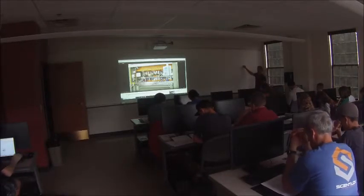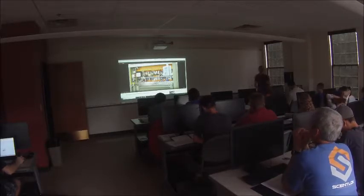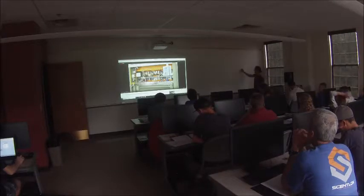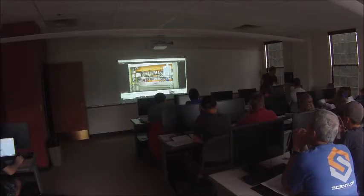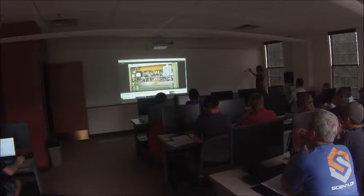Basically you've got what's called a punch, which is a roughly blade-shaped thing. This is a cross-section, and it's long; however wide your part is, that's how wide your punch needs to be. Then you have a corresponding die called a V-die. Typically your V-die is a different angle than your punch, and then you take your material and lay it across there.